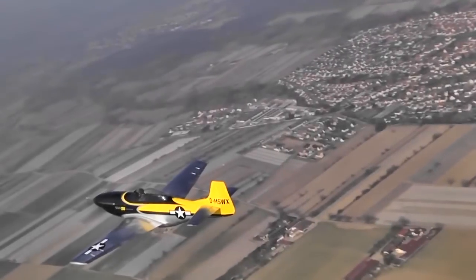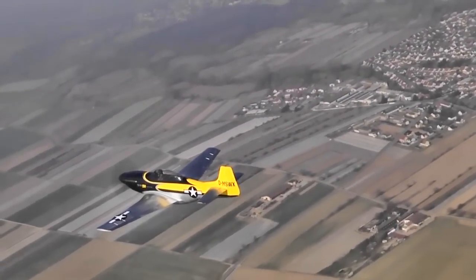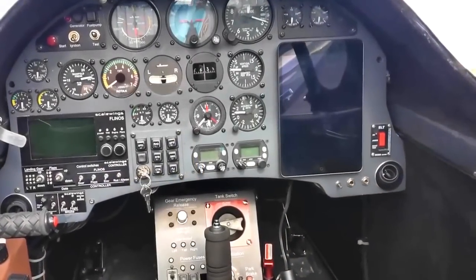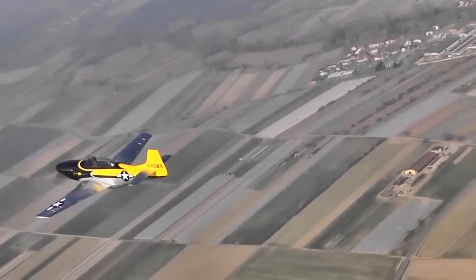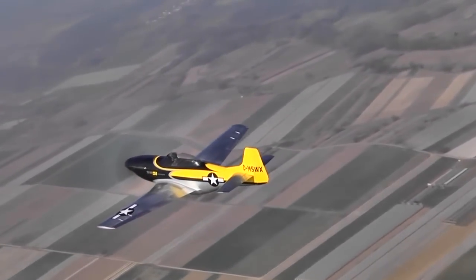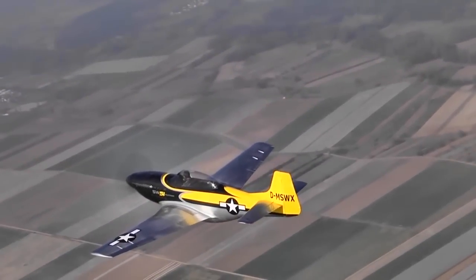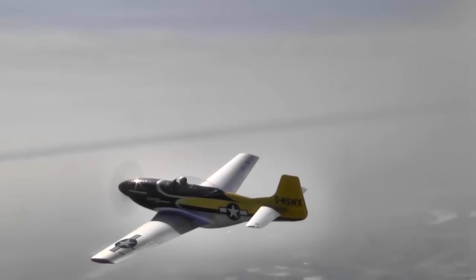Yeah, cool. You've got mechanical pushrod flight control surfaces, the ailerons and elevator are all mechanical. You've got rudder cables just like you would on most any other airplane. You've got electric trim on the ailerons, the elevator, and the rudder. So that's standard. Three-way trim then. Yeah, it all works electric. Flaps are electric too, I'm guessing. Flaps are actually electro-hydraulic, so you've got an electric hydraulic motor that'll run the flaps and the gear. Okay. So it's a real reliable little system.